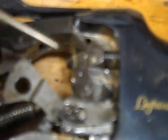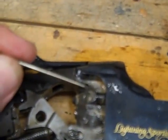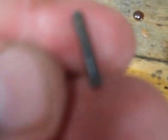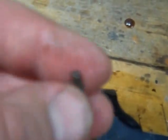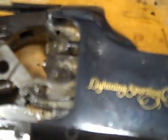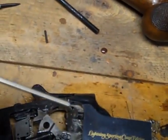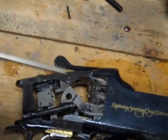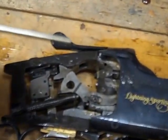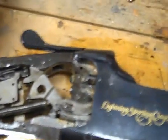So this is the hole where the retaining pin is. And as the directions say, tap this out from the right side, which is what I just did. This is the little pin — maybe one side is knurled. That's the side that came out. I didn't have a punch small enough, so I cut a little piece of nickel silver rod, assuming it wouldn't do any damage since nickel is fairly soft compared to the steel components.